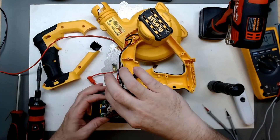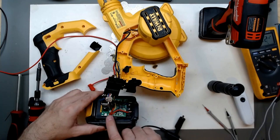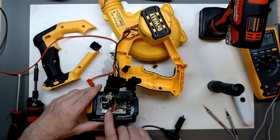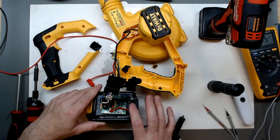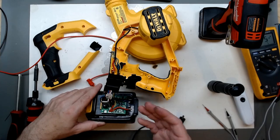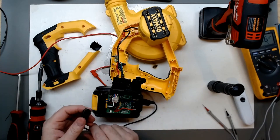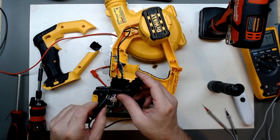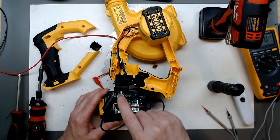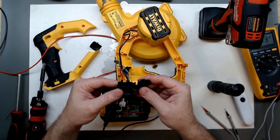It could even be the microcontroller on this board. The contacts conveniently take positive from the battery terminal, go through, and come back through the blue — it's basically a safety interrupt where the electronics handle speed control and probably also drop battery voltage monitoring for battery management and protection. But we can't get the MOSFET to do anything. For testing, I can jump — carefully, not shorting the 20 volts — our minus off the battery, bypassing the MOSFET, up to the blower. Now the trigger will just pass the full 20 volts to the motor.